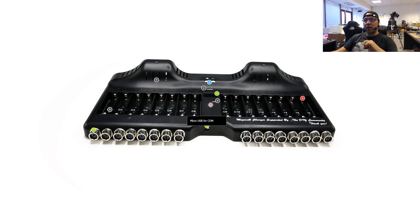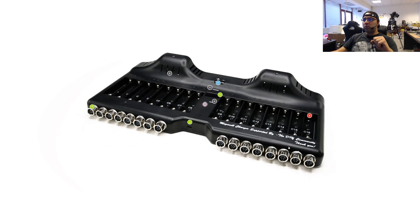We have 16 slots — same number as before — but compared with the early version of the Mega Cell Charger, we now have 4.2 amps per cell capability for charging, and we can also set the variable voltage from 3.5 volts to 4.4 volts, so we cover a wide range of cells. Previously you could set the voltage in Mega Cell Monitor but the current would not drop off and follow the curve properly — it would be a steep interruption when reaching a target voltage and the cell would not be topped up. With the new IC we're using for charging, we have the ability to set the target voltage and it will follow the charging curve to make sure the cell is fully charged.